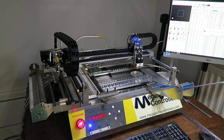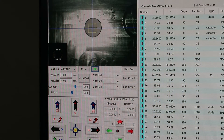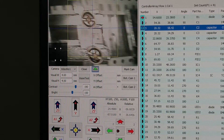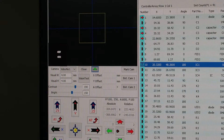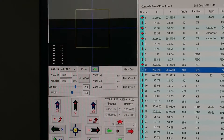I should point out I've had this machine for 24 hours, so I've only configured a few feed lines and only for a single board, but the thing's doing great service already. And here you can see what the PC sees with the vision camera — it's looking at the legs. You can see in the bottom left the last image where the vision system has analyzed the chip, and now it's placing it in the right position.